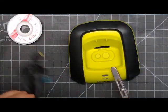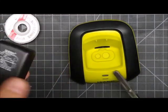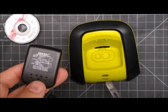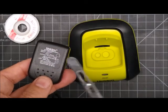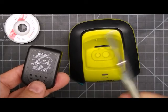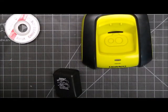Now it is possible that your capacitor went bad and that it cooked your power adapter. The power adapter can go bad. Usually when the adapter is bad, the light won't light up or it'll blink. Technically it's possible it could light up solid and still not charge, but that would be very uncommon.